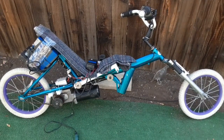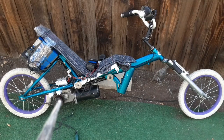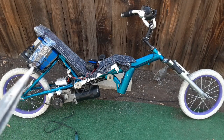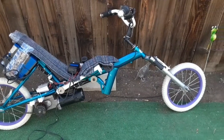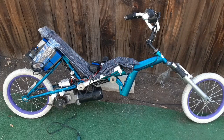All in all, for something pretty cheap to hack together — I already had the motor. The control box, throttle, and all that stuff was probably about thirty dollars. The small kids bike for the wheels was four dollars at the thrift store and the mountain bike was seven dollars. Without the batteries you're really looking at about 60 bucks to build this. If you go with the old throttle and controller it's about ten dollars more but you can put any battery from 5 to 60 volts and it would work. All in all it worked out pretty good — that's all I have for today. Until next time, build stuff and have fun.